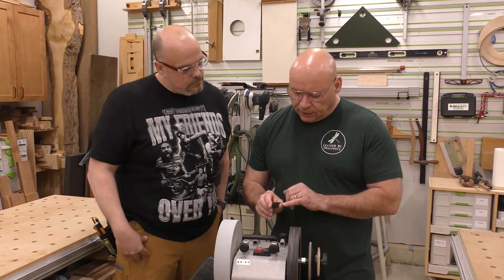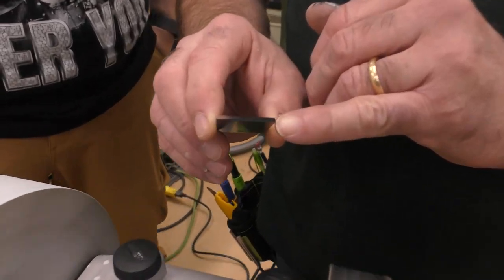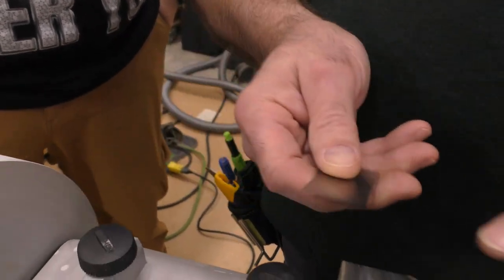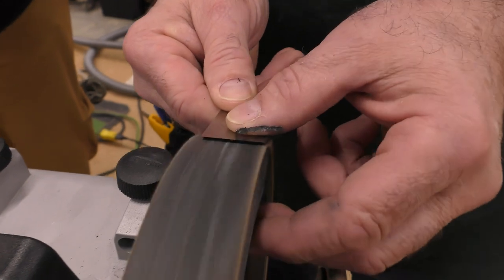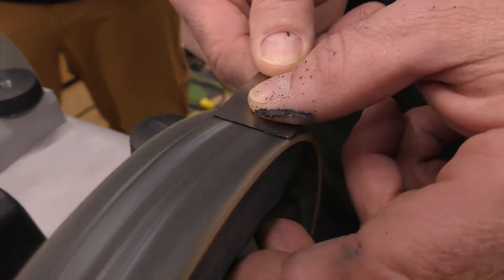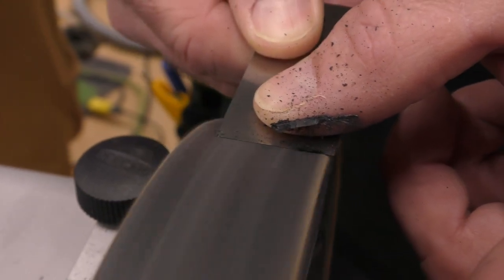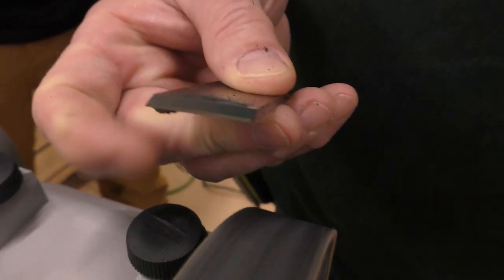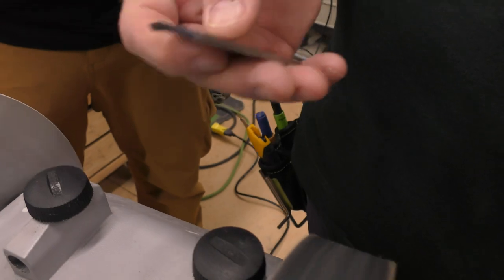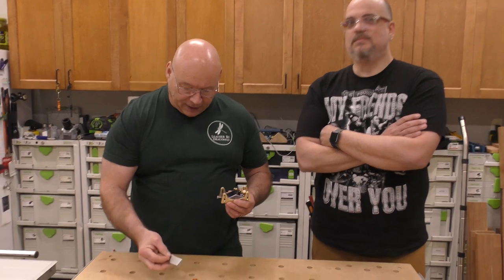I'm going to take it to this honing wheel like this. I'm hitting that 25 degree right now — I can feel it — but I'm going to bring it up and you can actually hear it on that micro bevel. You're going to see how this produces a really nice shiny edge. So now you're ready to put this back in the block plane, the HPA, and get going. We got a really good hone on the blade.